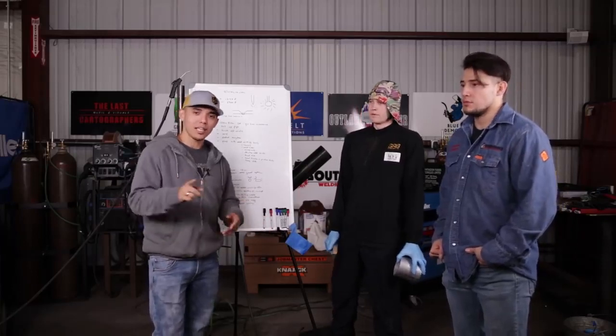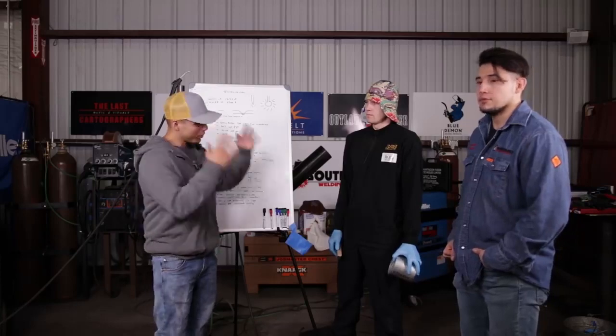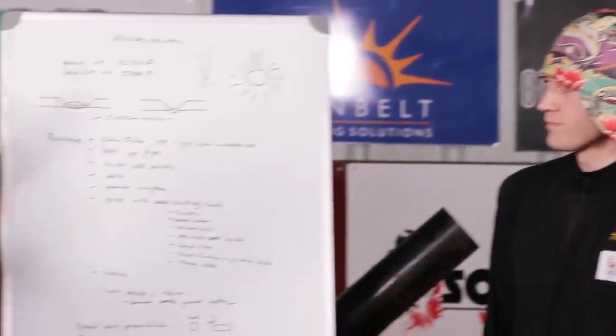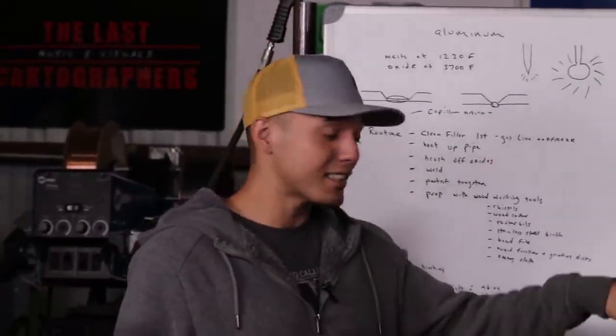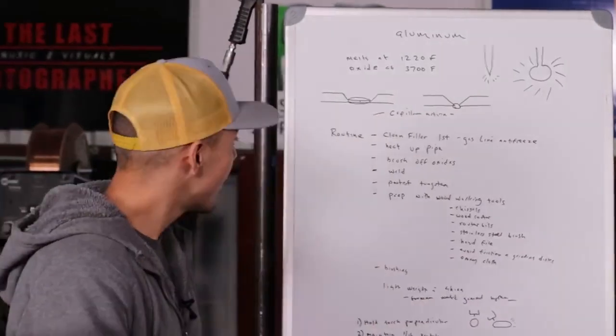And welcome back. Today's lesson, we're doing an open root pipe tutorial on aluminum in the 6G position. We got Travis Field here. He's going to show us the introduction to aluminum, and we're using 6061 aluminum pipe and 4043 filler wire.